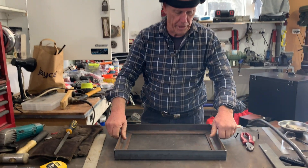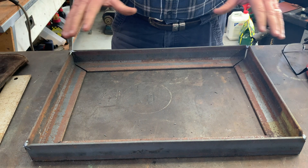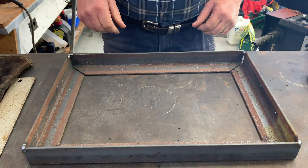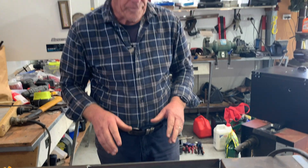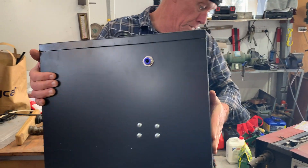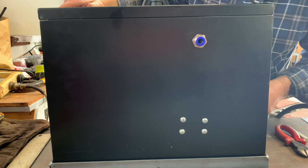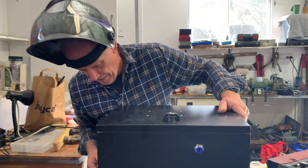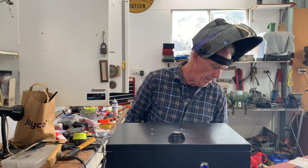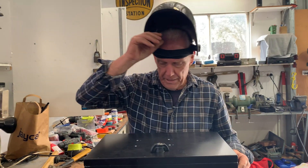We've just tacked the four pieces together to create the base. I'll set the box in there and make sure it fits up before I go welding any further, and then I can weld it all up. It'll be nice and strong — it's a good solid base and will certainly carry the weight. That's a good neat fit, exactly what I was hoping for. I don't want the thing slopping around in there — it will be fastened down and secured. But the neater the fit, the better. I'm happy with that.